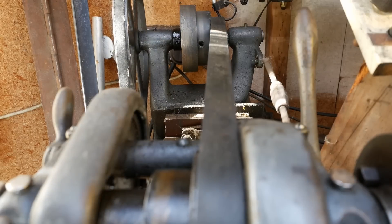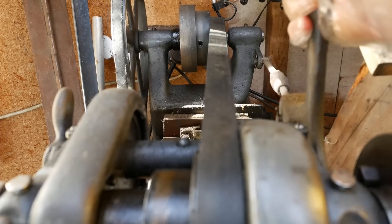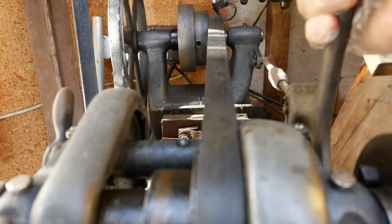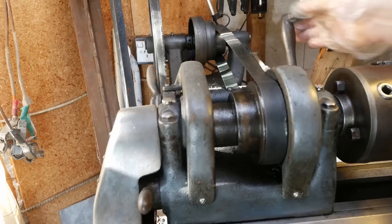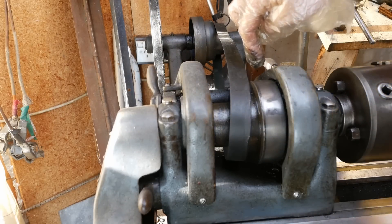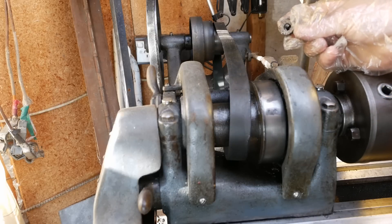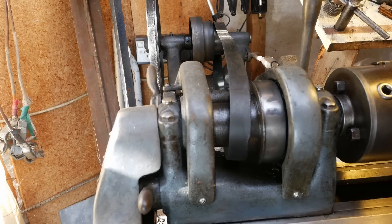The drive comes from a motor up through a big reduction, then you've got a three-speed pulley. Unfortunately this is totally misaligned - looks like it's just been badly bolted down to the bench and just needs to be moved over and bolted down properly. Obviously not good for the belt, that misalignment. In reverse you can see it's been rubbing on the cast iron. There's one of the nuts to hold it down - I'm guessing the bolt came unscrewed and it's probably lying on the floor somewhere. I went looking for the second bolt hole in the table and I can't find a hole, so I'm wondering whether it's always been sitting here loose.